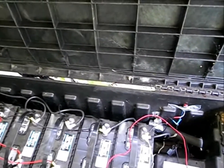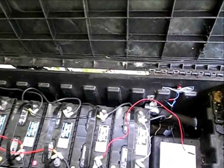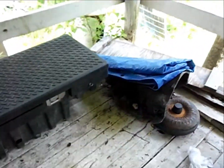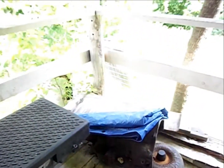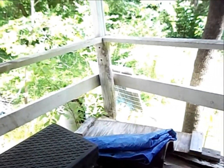Before when I turned the video off a second ago, I had over 14 volts of power going to my batteries — almost 15 — so that's quite a lot, that's some good sunlight. I'm going to be able to reduce solar panels throughout the summer unless I find some other way of burning off that power. I've got a fan running right now in the house and the old cabin out here. I got the lights to stop blinking — this is awesome. I was really scared I wasn't going to produce enough power, that's why I bought so many through the winter.